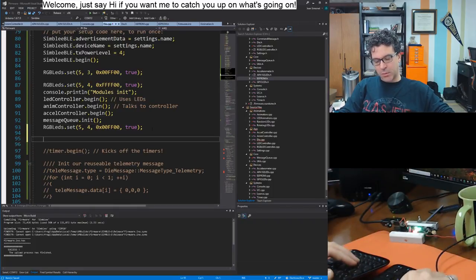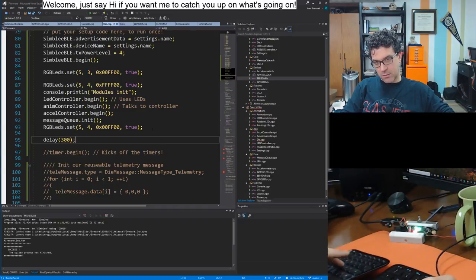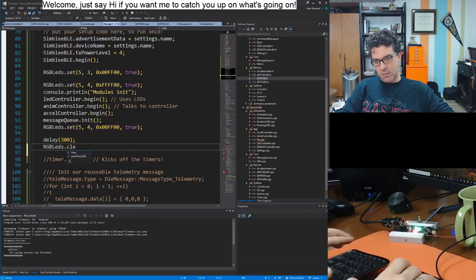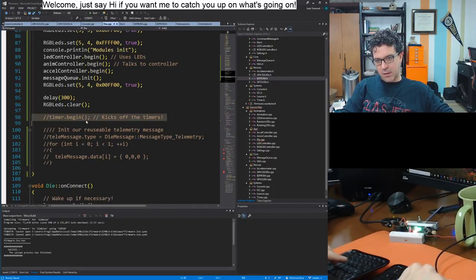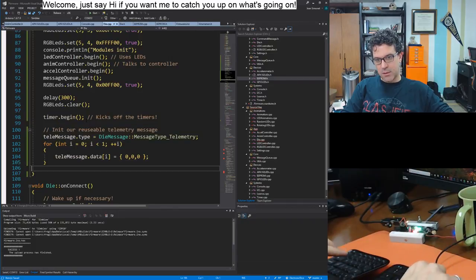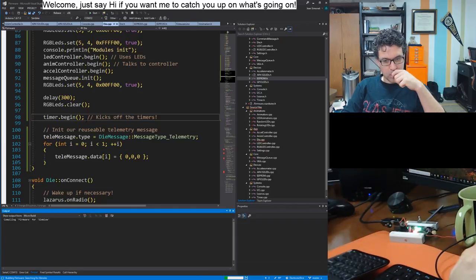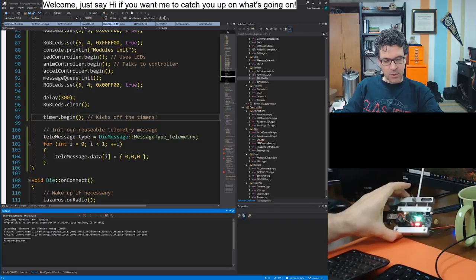And then if everything's cool, then we'll delay, I don't know, 300 milliseconds, and then turn everything back off, because we don't actually want everything on all the time. And then just undo this, and hopefully we make it past everything. They're too bright. I need to make them not as bright.